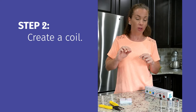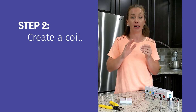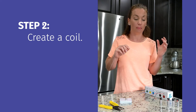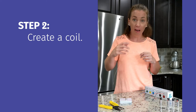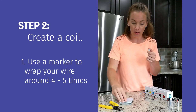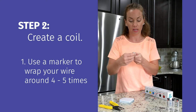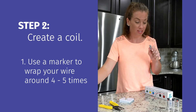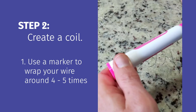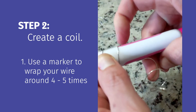The next step is to coil the wire — this is a very important step. You want the coil big enough that it doesn't touch the battery or the magnet, since it has to float around them, but not so big that it falls outside the magnetic field. I use the diameter of my battery as a reference — the magnets should be similar in size — then find something in your house that's a little bit bigger, like this marker.